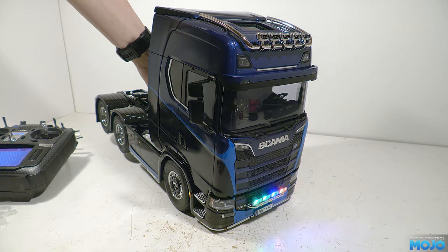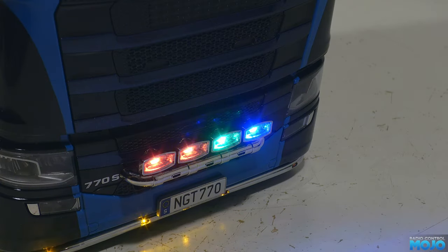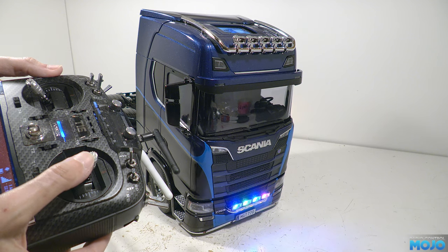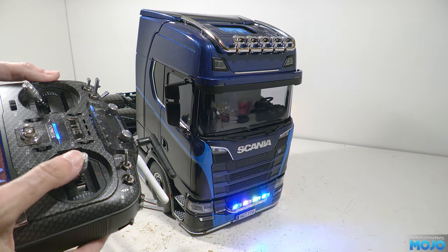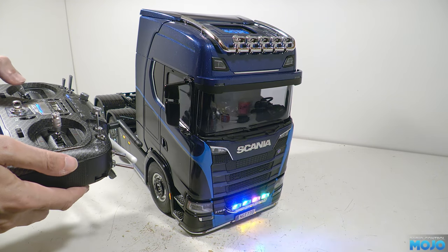Power-up time. For now we've just got some test animations. The first spotlight is cycling the four LEDs — red, green, blue and white. The other three are hue cycling. The orange LEDs are just flashing on and off. The main thing is we can see they're all working, which is nice. Once we have some software that does something more than test animations, we could have them behave like police lights or flashing beacons. We could even tint the white spotlights to be warm or cool. If the truck's being towed in reverse, maybe we could use them as tail lights. There are a lot of possibilities.